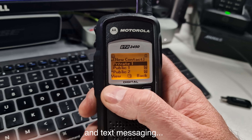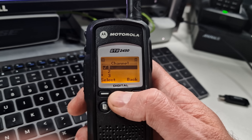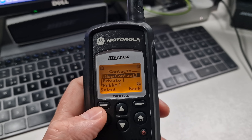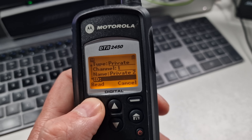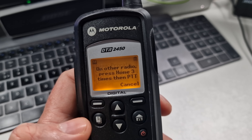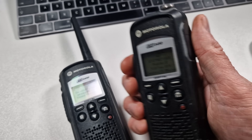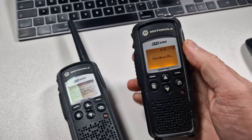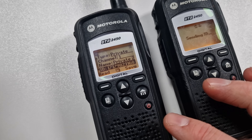Very interesting indeed. But I will say the private mode — you have to select it. You've got a number of channels you can use and it only goes up to 10. So these are basically your frequency hopping patterns — you've got 10 to choose from. So is this really secure? Because surely you could just put the ID of the other radio in and then just try each frequency hopping pattern until you've got the one that works. No, it's not actually as simple as that. Because if we go into the menu and make a new contact, you can only read an ID from another radio — you can't actually type it in. So even if you read the ID, you then have to have the other radio on hand and do this process: on the other radio, press home three times and then press the PTT, and then it will send the ID to the other radio. See, it's done it — so it's kind of like pairing it in a way.